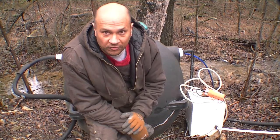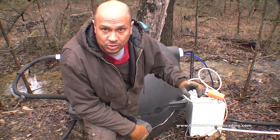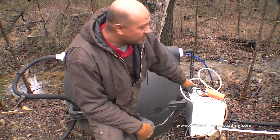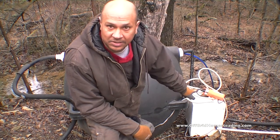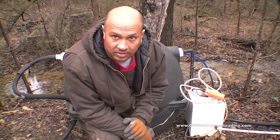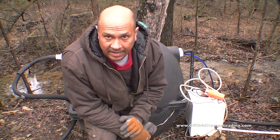I've been using a SureFlow diaphragm pump for the first year and a half. The diaphragm pumps work great — they can actually siphon in about 7 feet of pressure, and then pump it up the lines going to our upper cistern. The challenge is, when it gets cold, that box gets real cold. The parts inside start freezing and the components start failing. That failed a little bit after last winter, and the components are failing again.